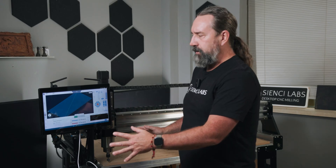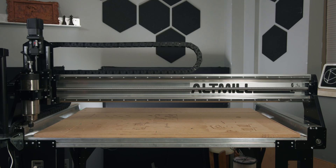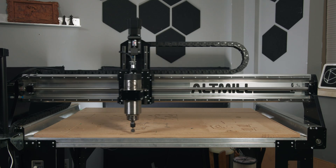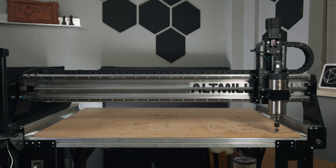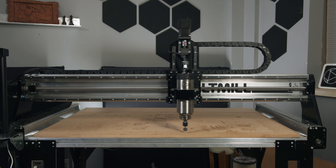What I recommend doing is what I've done here — raise the Z up and set the zero so it's going to cut above the surface. This is a great way to test to make sure it's going to run the full surface that you want to do. You can also hit the outline button. For this purpose I'm just going to hit Start. It's going to do an initial pass and go around, machine and do a couple of passes, lower into the table, and then start cutting. Now that I saw it made the full circuit, I'm very confident it's going to do the surfacing pass back and forth. At this point I'm confident to say you can zero to the surface board and then start your job. Let that run, come in here with the shop vac to keep the dust down, and then Bob's your uncle.